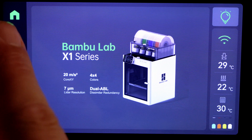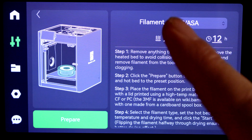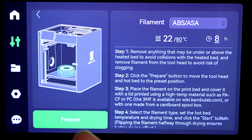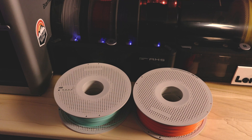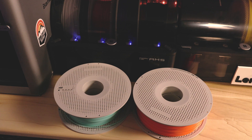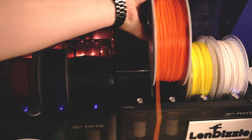To dry the filament, go to Utilities, then Dry Filament, and select ABS — it's already selected. We want to dry it for eight hours, so hit Prepare. We have two spools to dry, so it'll be 16 hours total. We have our spool cover printed from the PC video. Go ahead and get those loaded in the enclosure. Once both are dry, load them into the AMS.